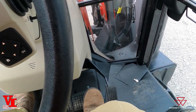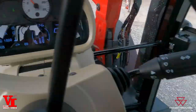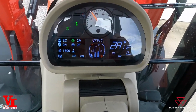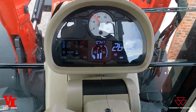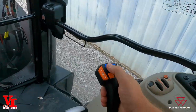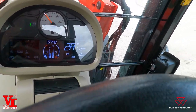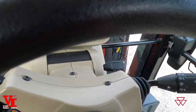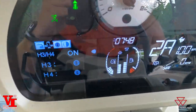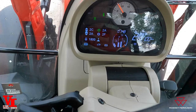You can set this into auto mode; this is stick mode. You can put it into foot pedal mode — now that allows us to drive the tractor with our foot and it'll change the power shift speeds. You can see we're up to 2F right now. That's another option if you're going down the road — changing speeds by your foot. Now with the H3 mode, we can hit that button and you can see we went to gear range 2A. Then we hit 2F as our other one to go up to our power shift and increase our speeds — that's all done right here on the loader joystick. Hit 2A and it highlights in green. You have to make sure your H3/H4 is turned on to operate that on the loader stick.